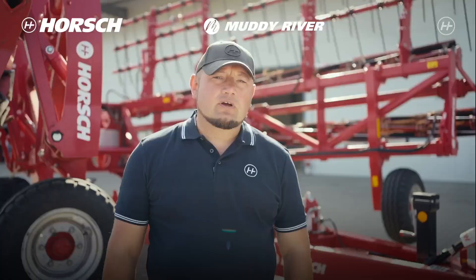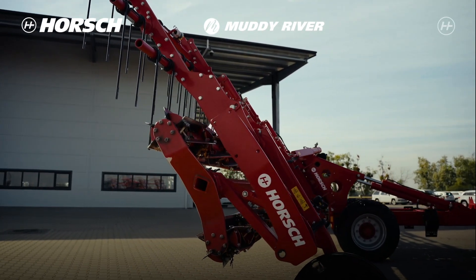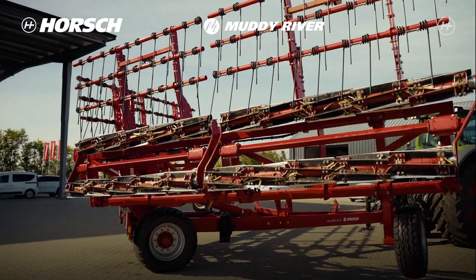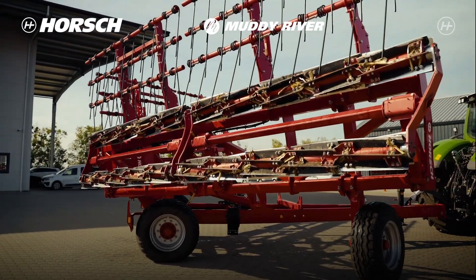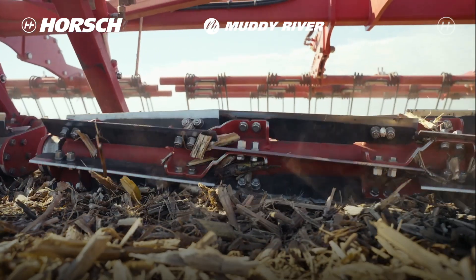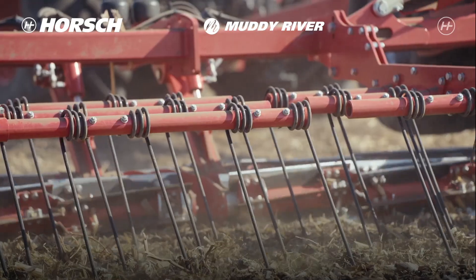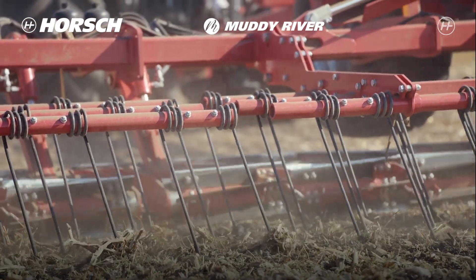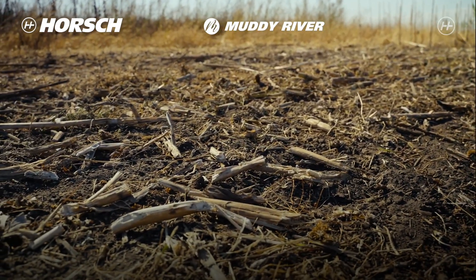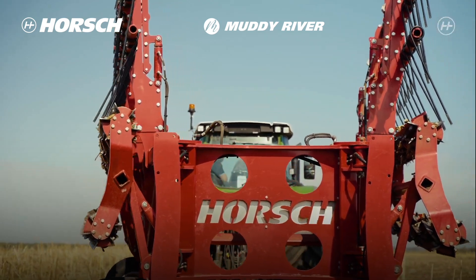The large working width of 12 meters results in a high work rate. We can manage up to 250 hectares per working day of 12 hours. We use this machine with tractors from 330 to 360 hp. The main tools of the Cultro 12 TC are the double knife rollers — six 65 cm knives mounted diagonally on a roller with a small diameter. The knives create a crosswise pattern for a maximum crushing effect. Behind the knife roller there is a three-row harrow with 14 mm spring tines with carbide coating that excellently redistributes the straw residues. The tines are adjusted hydraulically and with clips. The transport width of the Cultro is three meters, approved for road transport.